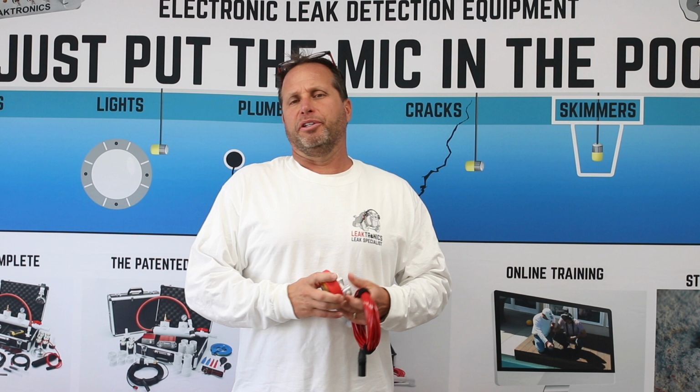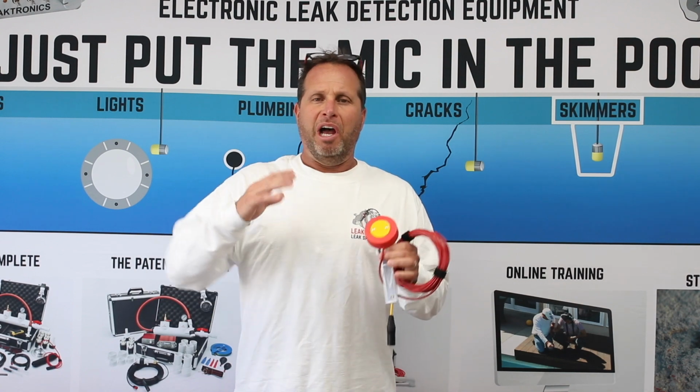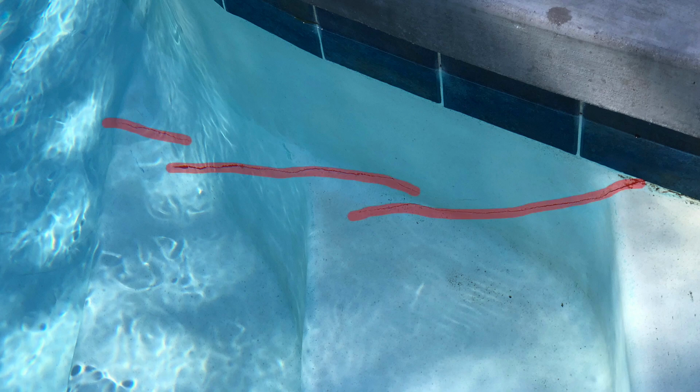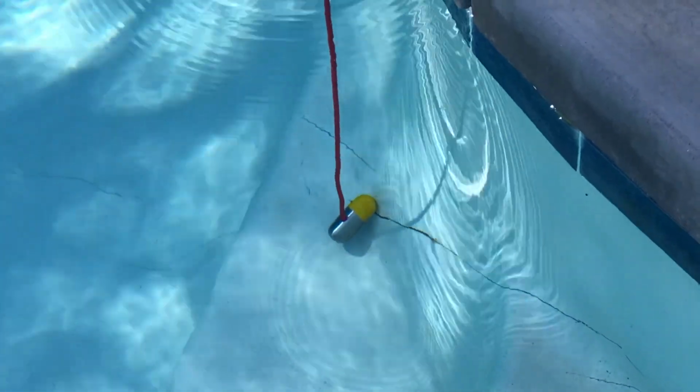So we're shooting this video to discuss structural cracks, the noises that they make, and how we go about fixing them. When you have a structural crack, as I described in our structural repair seminar, we talk about something called the sweet spot. We could have a 6-foot crack and only 2 inches of that structural crack will be leaking.